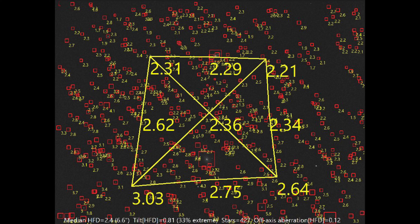There is software you can use — ASTAP, which is really a plate-solving software, but it has a CCD inspector built in where it gives you a graphical representation of any sensor tilt and also tells you in percentage terms how much you've got. I tested around 15 of my images on this and they varied from 10% to 33% tilt, so I'm not really sure how accurate that software is.